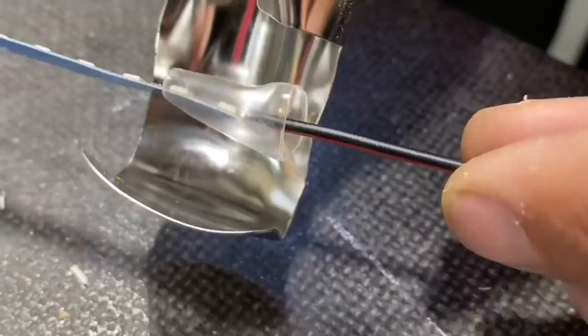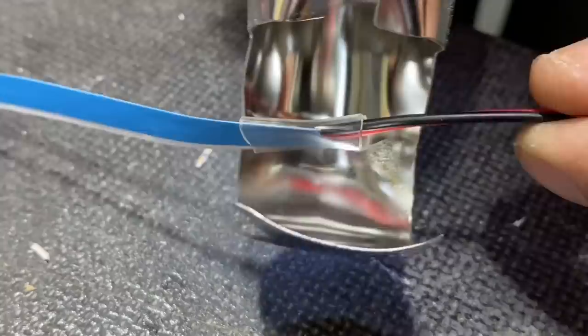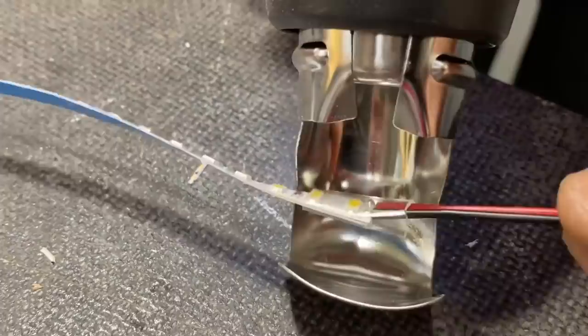The strain relief is probably more important with the soldered connection because it's incredibly easy to tear the wires and PCB pads off the LED strip if you catch it on site. I'm not sure I'd want clear heat shrink if I was doing the soldering — I'd go black. It's a good thing this is clear heat shrink; a lot of people supply LED tape with opaque heat shrink, so you'd actually lose an LED. I think I'm going to stick with the insulation displacement method.